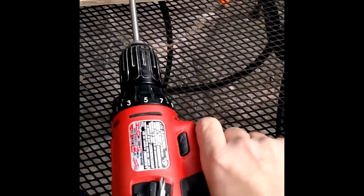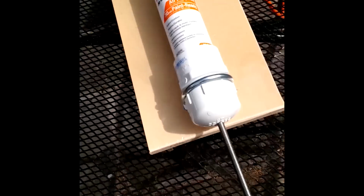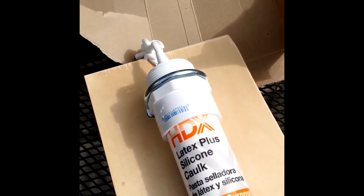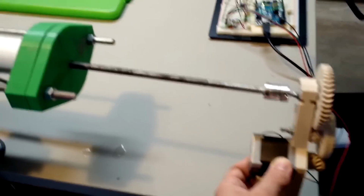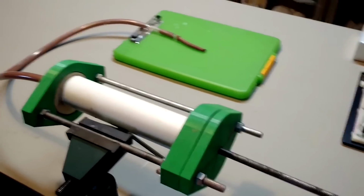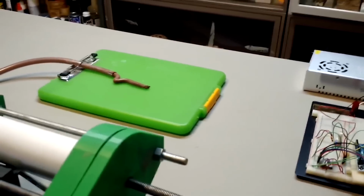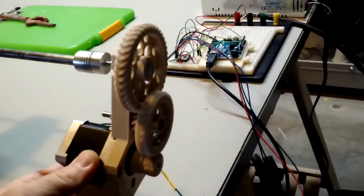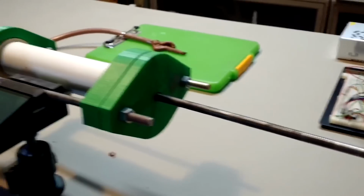for a number of reasons, we weren't totally sold on that, and I went back to the drawing board myself and just started conducting some of the dumbest tests you could imagine, just to see how you could use mechanical force to move a thick fluid and to extrude something. And so these tests started maybe a little bit crudely, just using an Arduino and some PVC pipe and pushing some really wet terracotta through a hose. Again, this is not controlled by any kind of printer, but just thinking about what does it take to extrude clay mechanically, and how much control could you have over that process?